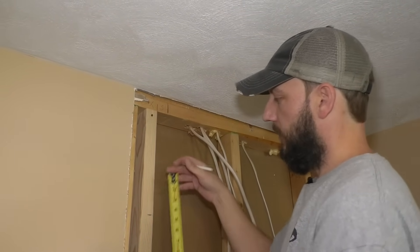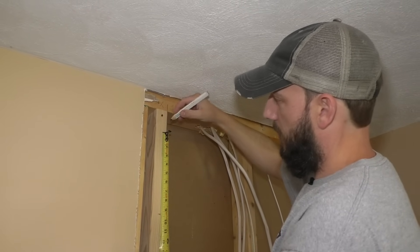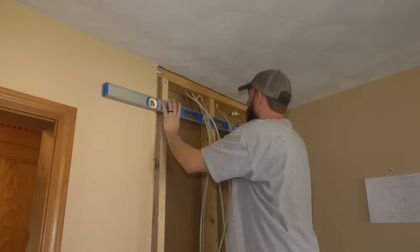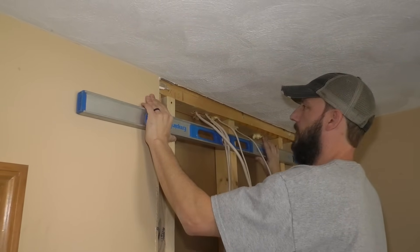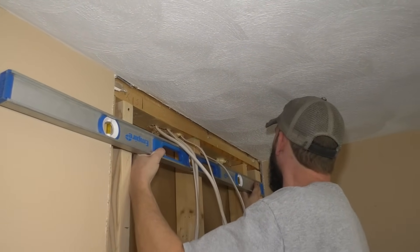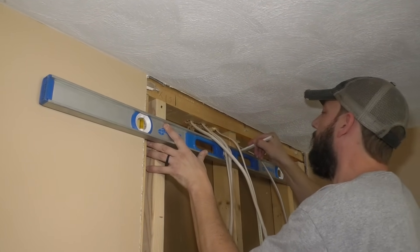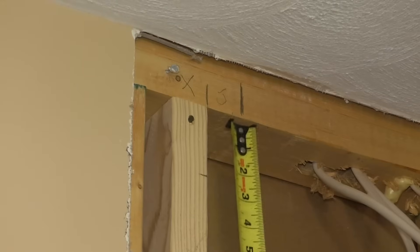That will definitely be covered with trim. I'll measure off the floor and mark 81 inches right here. Now I don't want to cut anything out yet because this is actually where the header is going. I'm going to mark — it's a 2x10, which the actual measurement is 9 and a quarter — so up here I'll mark nine and a quarter. This is where the header is going to go. Then I can take my four-foot level and hold it to that mark to judge whether these wires will clear.